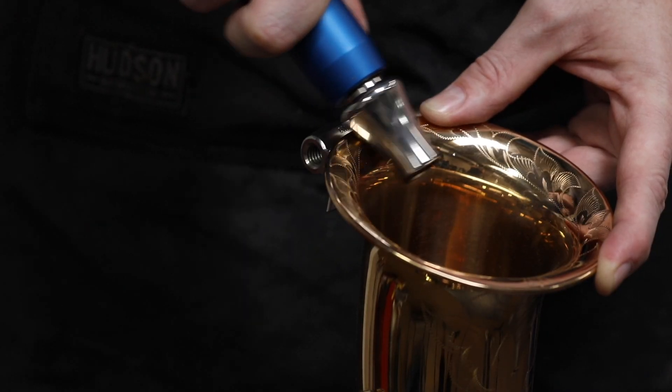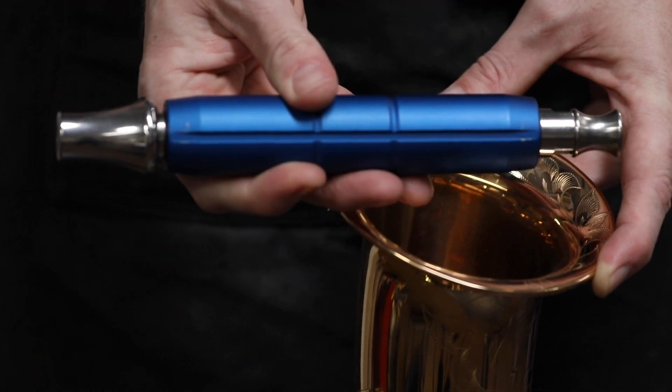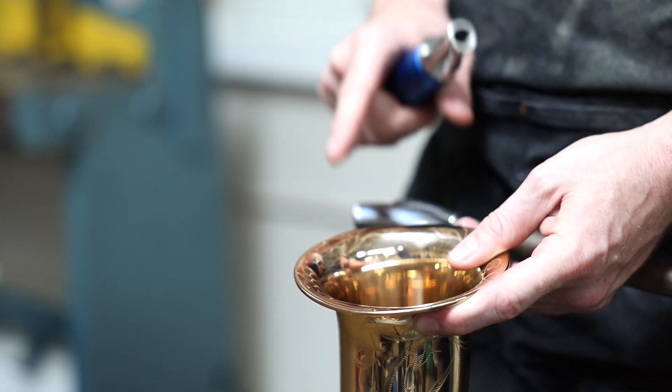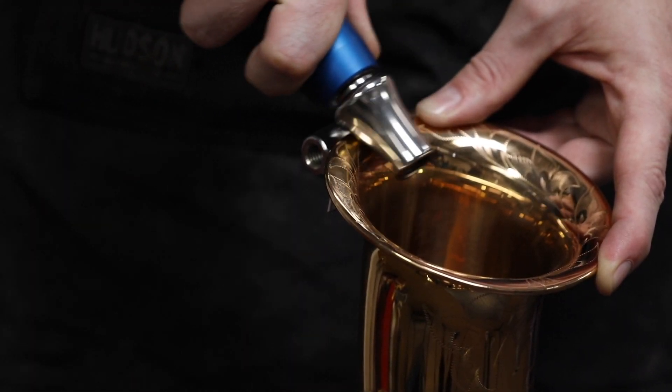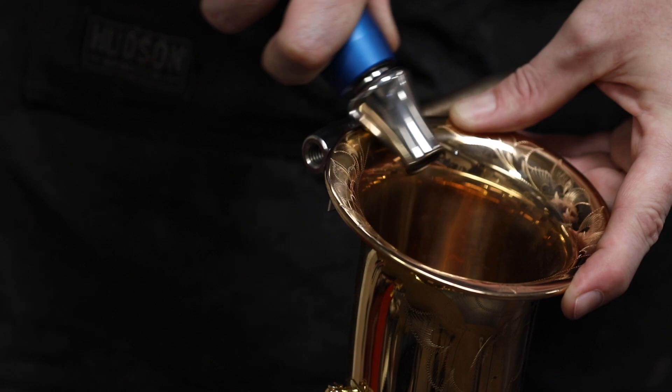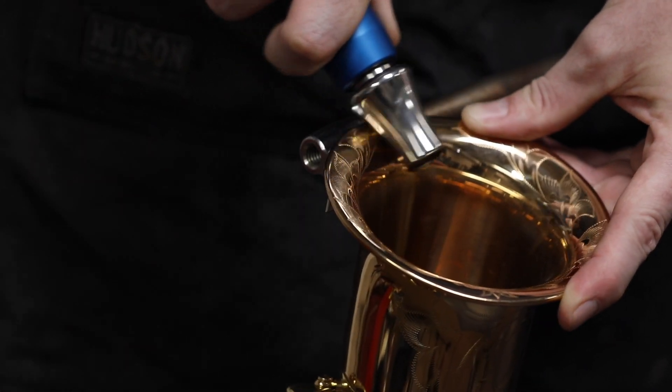You can feel that hump from the mandrel. I like using the hand unit by itself because we don't actually need a lot of force to change the shape of this relatively soft material. Remember, the roller is steel and the mandrel is steel, but the bell is brass — it's the softer material that's going to give. I don't want to use too much pressure as I rotate the bell and the tool to get all the surfaces. We're just gently rolling it back to where it needs to be.